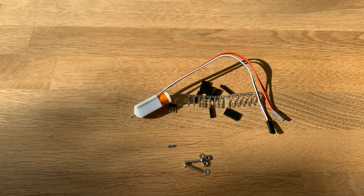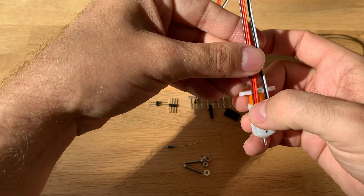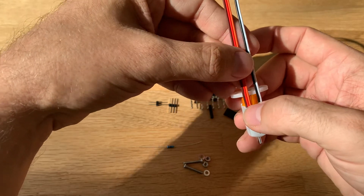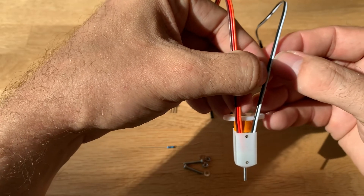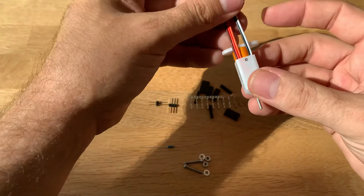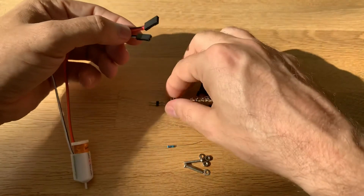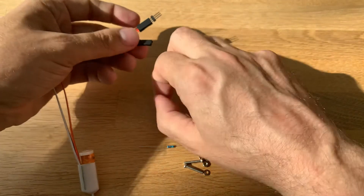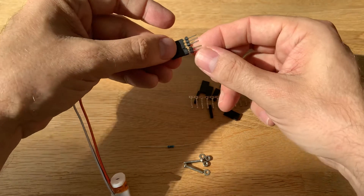In the manual it definitely states what each wire is. Brown is ground, red is 5V, orange is the signal, black is ground again, and white is Z-min. Just with this information you should be able to connect it. You can use the included connectors so you don't have to swap anything, or you can swap them here if you need to fit your board.